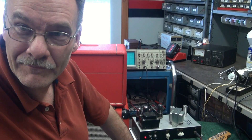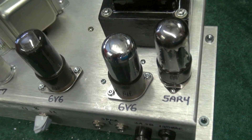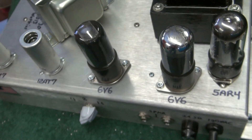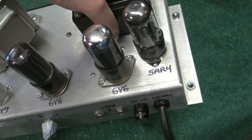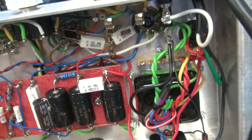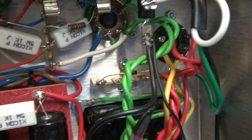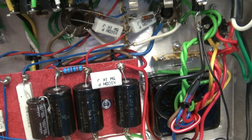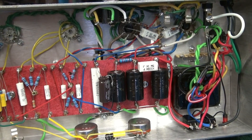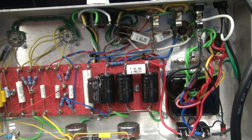So let me give you an overview of the chassis. It's a huge thing. Here is the new pair of 6V6s, and the 5AR4 that I kind of had to strategically tuck in the side of the chassis — but there's plenty of room, luckily. And then the underside — there's the rectifier socket back under there. I left the diodes in there just for the fun of it. So this boutique amp is up and running with a new set of 6V6s — it's a whole new amp.